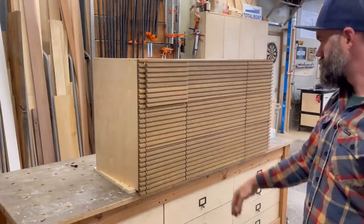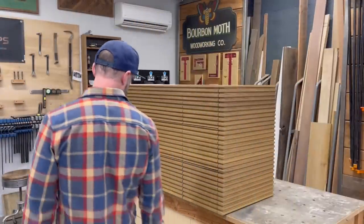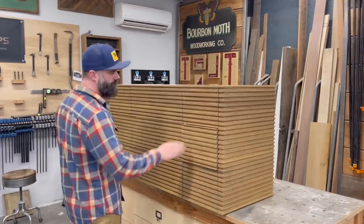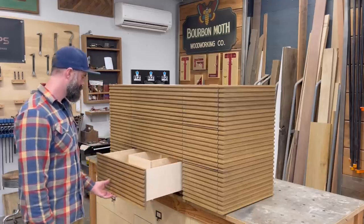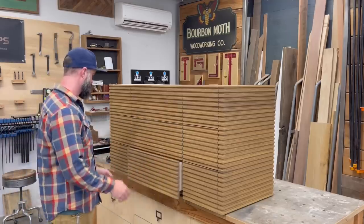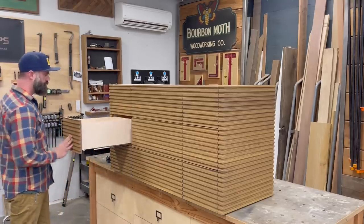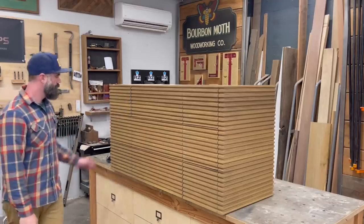Click, click, boom. I know it might look a little plain right now, but you have to imagine it with a white marble top and a wall-mounted brass faucet — I think it's going to look pretty darn good, floating just above the floor in the bathroom of our new addition. I also made these horseshoe drawers in the middle — maybe I forgot to mention that — but that's to make sure they go around the plumbing. I show that in another bathroom vanity video if you want a step-by-step on how to make horseshoe drawers. But for now, the vanity is done.